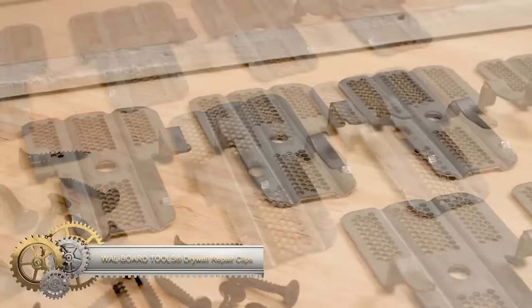The Fetra plate roller with clamping jaws is an indispensable tool for forming sheet metal into cylindrical shapes, offering both professionals and DIY enthusiasts a precise and efficient solution. With its adjustable rollers, it can cater to various sheet metal widths, and the clamping jaws ensure the material stays in position during the rolling process. From crafting cans to shaping cones and tubes, its versatility makes it invaluable. Always wear protective eyewear, ensure the metal is securely clamped, and lubricate rollers to maintain smooth operation.